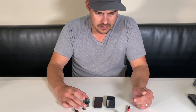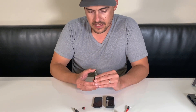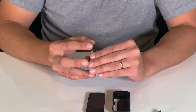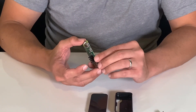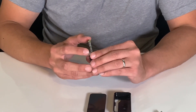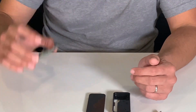There are two places that this cable will fit into this board, but they are not equal. This one right here is power — most people will be inclined to plug into that one. But because the Raspberry Pi is acting as a USB flash drive, we need to plug into the data port. That's going to be this one right here. When we get the case together, it'll be the one in the middle.